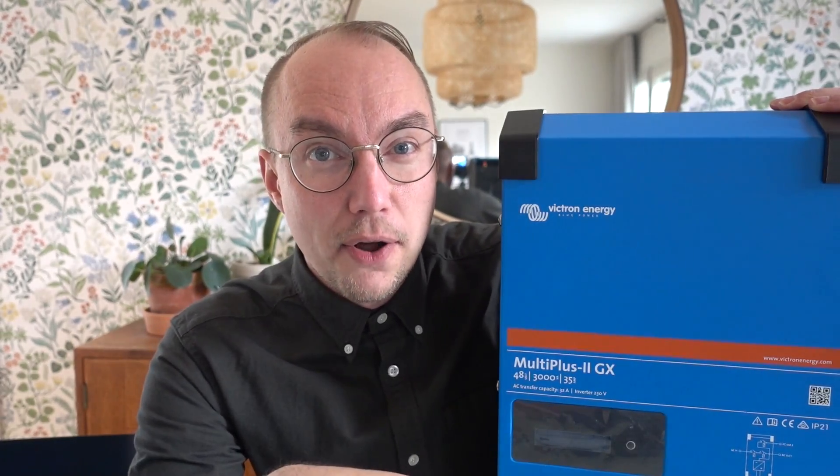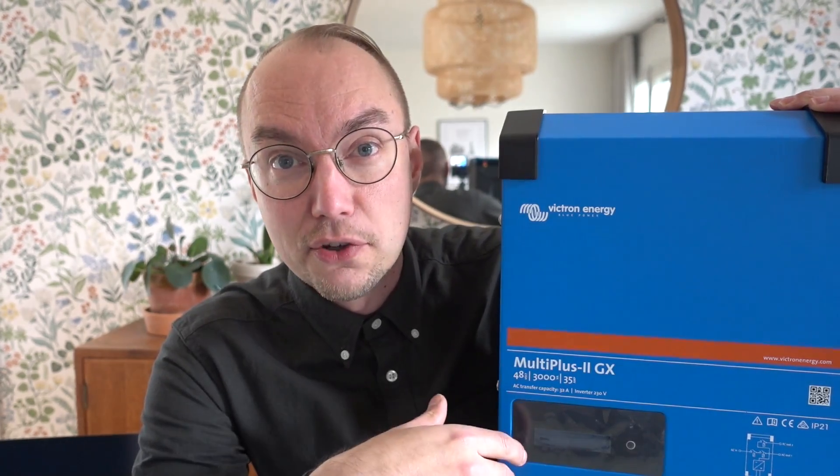This inverter, apart from being one of the heaviest things I've ever bought, is a really cool piece of equipment. It's capable of both on-grid and off-grid operation. When you have batteries connected, you can have critical loads connected directly to the unit that will be uninterrupted — if you have grid power it will pull from the grid, and if you lose grid power it will take energy from the batteries. You can also run it completely standalone in an off-grid solution, and you can connect multiple units together to create your own three-phase networks. Home Assistant has native integration for these units, so it should be really easy to connect the two together and have them working well together.